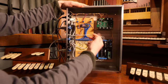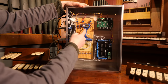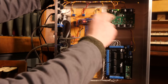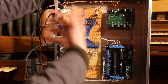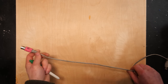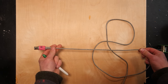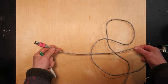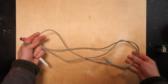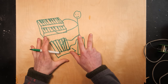After merging all the messages together from the two keyboards, the pedals, and anything else coming in — like information from a computer — this then talks to this circuit board right here. What this circuit board does is basically allocate the information coming in from the keyboards to whichever pipes it needs to go to. The MIDI data comes through a MIDI cable, and at any one time with a single MIDI cable you can actually control 16 separate things — for example, 10 synthesizers and six drum machines all at once — just by telling them to listen to different MIDI channels, one to 16. I've used that to make the organ work as it does.